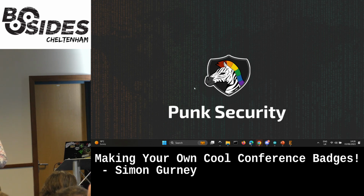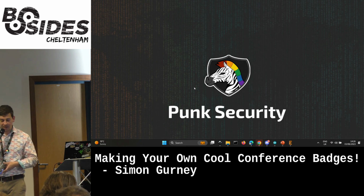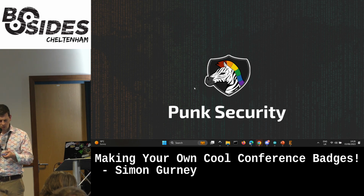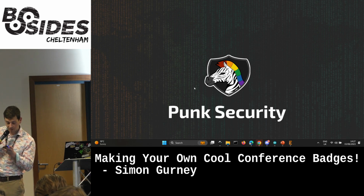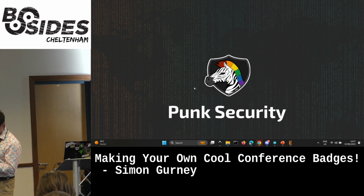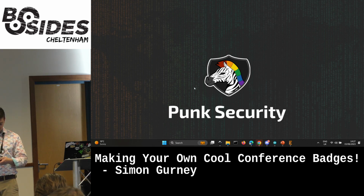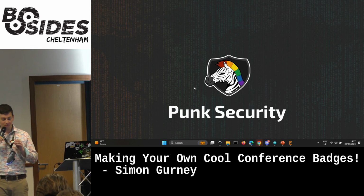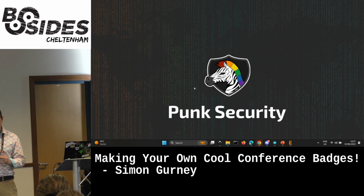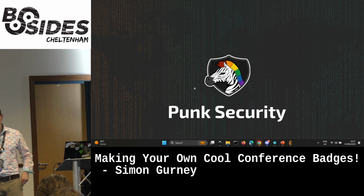The original ones I did were tiny because I was using the free license. But then you get other things that are really painful and you won't get them until you send them off. So some of these DeLoreans, they do some sort of weird pour for the copper fill and you'll get defects that way. Or on these with the silk screen, there are drag lines. I'm not sure how they're applying it, probably like a wet squeegee or something. We didn't get as much of that on the smaller boards, so I don't know if they have a different process for the bigger boards than they do for the smaller ones.